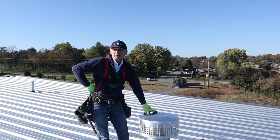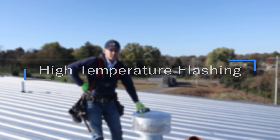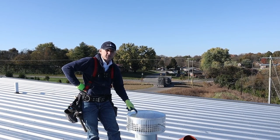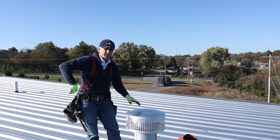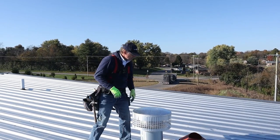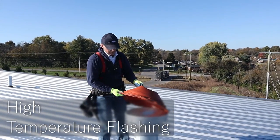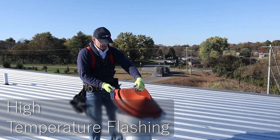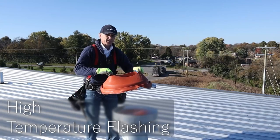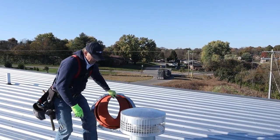This is an example of how not everything is super easy on corrugated metal roofing. Flashing the pipe boot for this exhaust vent — probably some kind of furnace — is definitely high temperature. Whenever you have high temperature, you have to have flashing that can accommodate that heat, so this rubber is designed to withstand it.